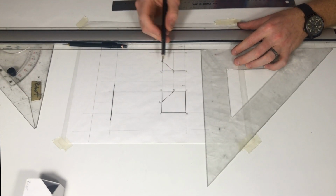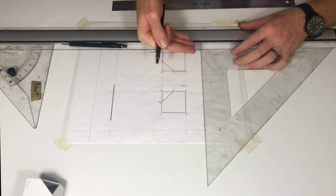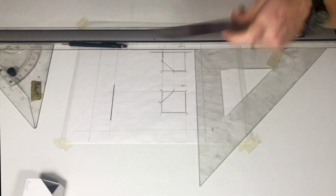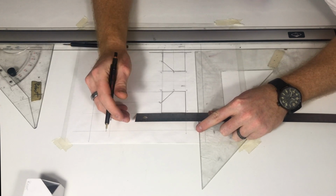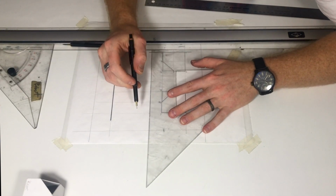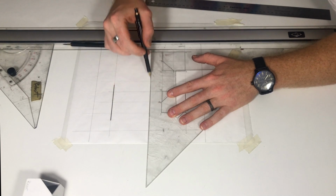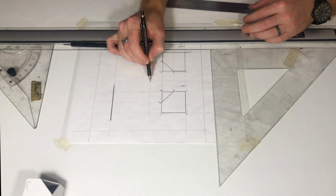And again, now I have a fold line, right, where this thing folded to this view. I can do a similar fold line to this view to help me visualize it and define where my hinge point will be. So I went 1 inch over, 1 inch over. The more precise you are with these and measured, it just makes things a little easier to track back later on. So now I have a located hinge point.